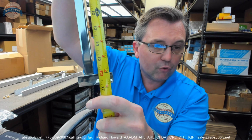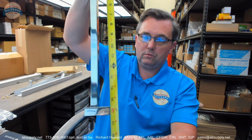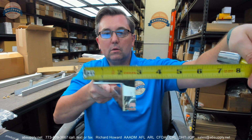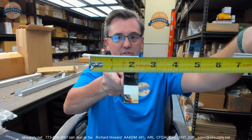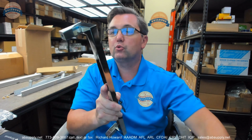Yeah, of course I said that wrong. It'd be 16 3/4 overall length. 16 plus 3/8 plus 3/8. 16-inch centers. Yep, that is indeed the case. So we know that it is 3/4-inch stock. The overall projection, 2 1/4. To the inside is 2 1/2. Okay. The total offset amount is about 2 1/4 as well. Okay, so very symmetrical sort of pull.